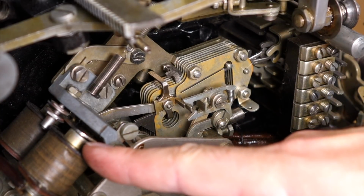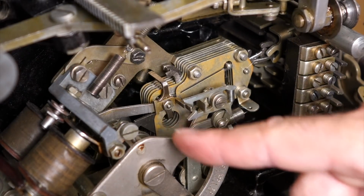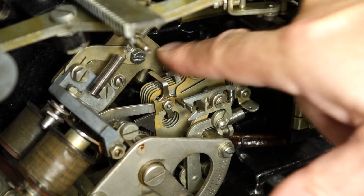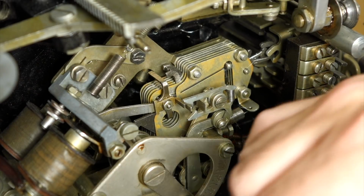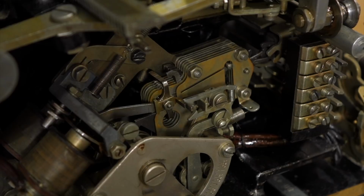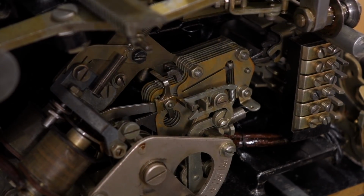So this goes really fast, and once it receives the start character, this starts to spin. And depending on the position of the magnet, it will set one of these 5 little levers here really quickly. And they are interposers, so they just fall into place, and then at the end of the cycle, something pushes, and everything that has the bar set in place will flip the Baudot bar that was in the front. So that's how you can do 45 baud, which is like 22 milliseconds per selection, something like that. Per bit, yeah. That's pretty amazing mechanically. So that's a couple characters a second.